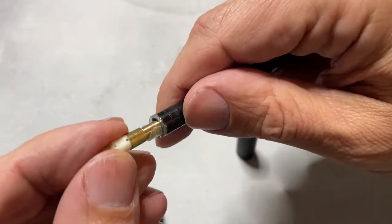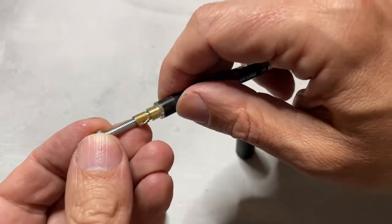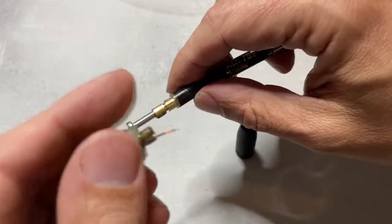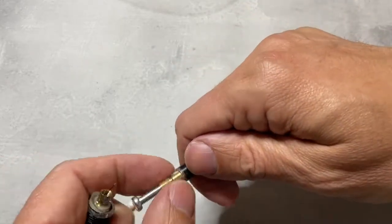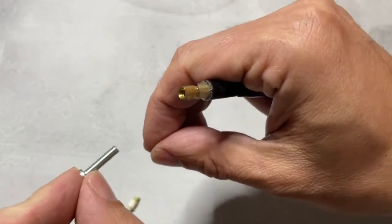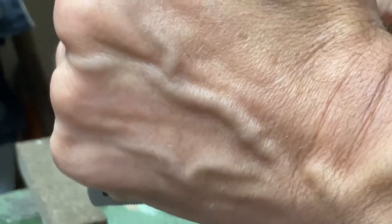Now, if we look at that, it looks a lot like this is a 4mm thread. And if we bridge that with an M4 screw, that should totally fix the issue. So I think if we just cut the head off that screw like that, that should more or less fit. So let's go to the garage quickly and take care of that.